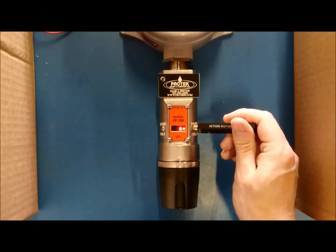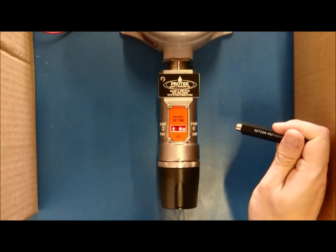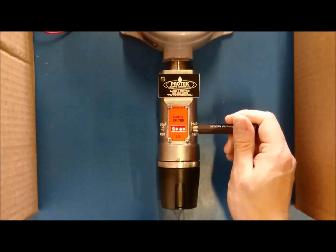After a few seconds, the operational display will change to read View Sensor Status. Hold the magnet over PGM2 until View Sensor Status scrolls past and then an arrow appears pointing right. At this point, immediately remove the magnet. Set Auto-Span Level will now read across the screen.